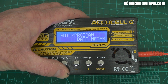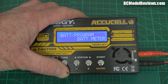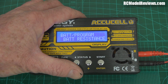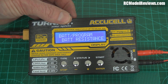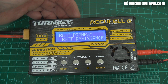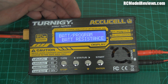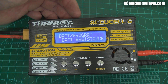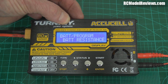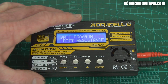The battery meter function is a little bit useless — if you plug a battery in it'll measure the voltage for you, but so will 100 other $2 battery checkers. But hey, it's there, you don't have to use it, it's free. Now battery resistance — this is a really good one, I'm going to do a whole separate video on battery resistance. That's the internal resistance of your battery, and it's a great way to measure how your battery is performing and how it's standing up to wear and tear. This charger will measure the internal resistance of your battery — it's a really valuable feature. We'll see how accurate it is, because sometimes these chargers aren't quite as accurate as they'd like you to think.